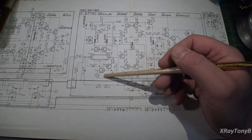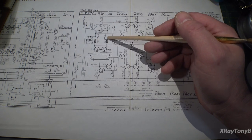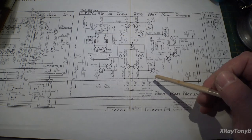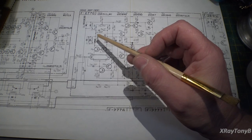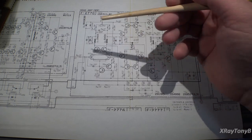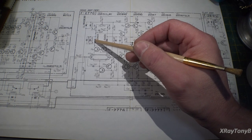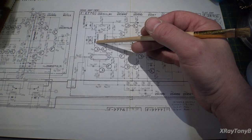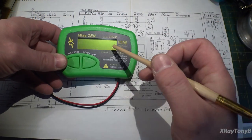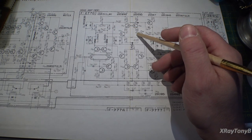It comes out of this stage, and you see these diodes used as voltage references — these SV03s. You see them all over the place in 1970s gear. You can use fast diodes like 1N4148, but they don't typically work as well as these little all-in-one modules, so I like to keep these when I can. What I'll do sometimes is remove them from the circuit and use a little device that will analyze them and tell you exactly the voltage drop to make sure everything's working.